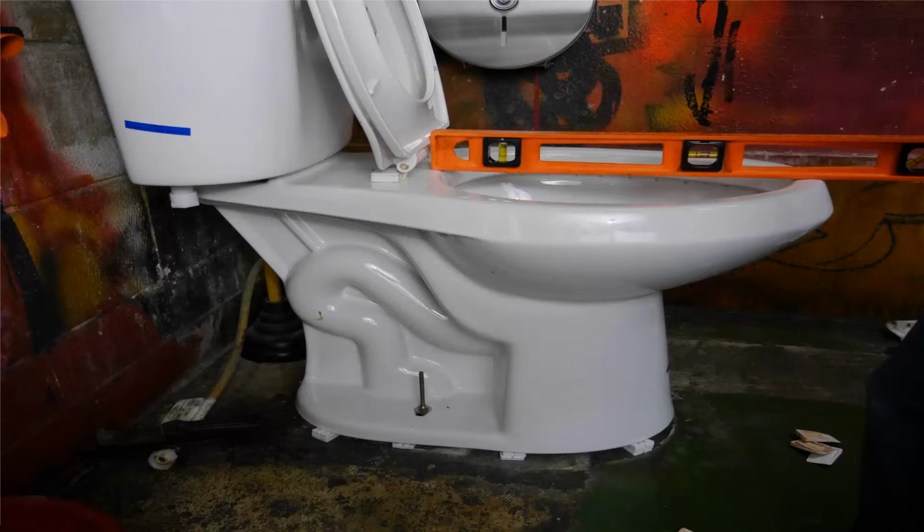After the bolts are snug and the stool is level, get some white bathroom silicone and put a line of silicone around the stool. An additional step you can take is to buy some plumber's putty and with your channel lock pliers grab each bolt right above the locking nuts at the groove. Bend the bolt sharply to snap off the ends. Then put plumber's putty in the caps that come with the stool and put them over the flange bolts.